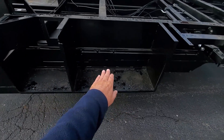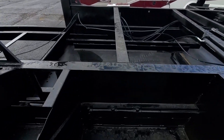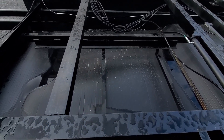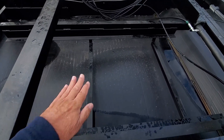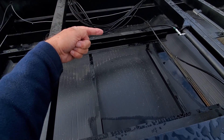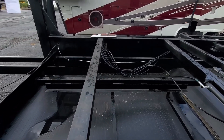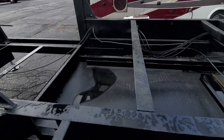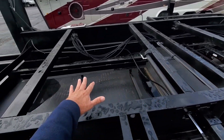This is where your water system manifold will go, and your tanks will be in here — gray and black, 50 gallons and 70 gallons. There'll be insulation all underneath, and insulation coming up the sides. There'll be Astrofoil-type inch insulation on the beams to keep heat and cold from moving through them. They have a minus-10 degree guarantee that you will not freeze up, and they can do that because everything under here is very well insulated.